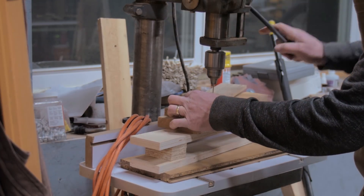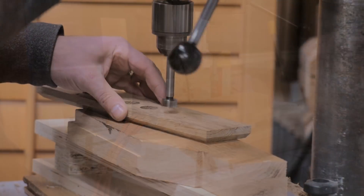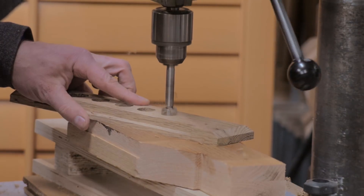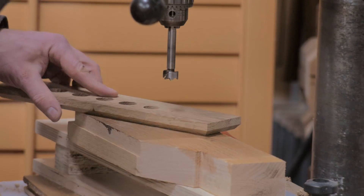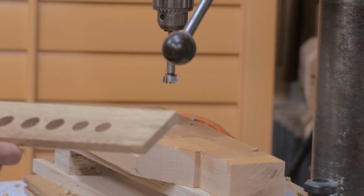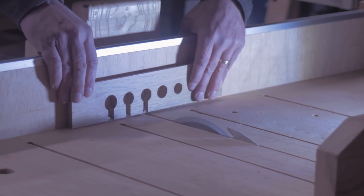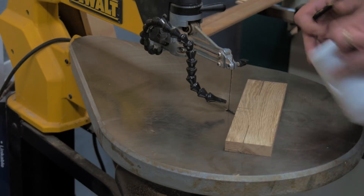To hold these, it's pretty straightforward — using some Forstner bits. I think I used about three different sizes based on the sizes of the chisels that I have. It's always good with Forstner bits to pre-drill a small hole, and that gives you a guide for where to drill in from both sides. That way you don't get tearout. Once you've got the holes in place, cut the openings for them. I was just eyeballing this until they looked right and made sure all the chisels fit in well.